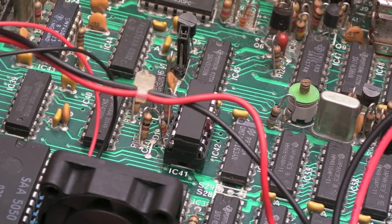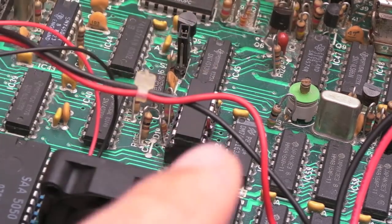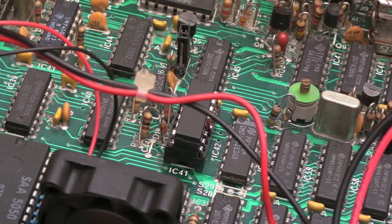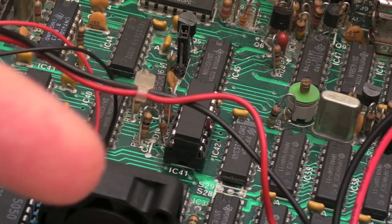So it's definitely not the 6845. I did later try sticking a bypass cap across the supply of the 6845, and that made no difference. And a few people were pointing out the sync level. In fact, I was only just above 300 millivolts. I think it's more common to be around 1 volt. Someone mentioned 1 to 2 volts. That might be okay. But I'd started at just over a volt,